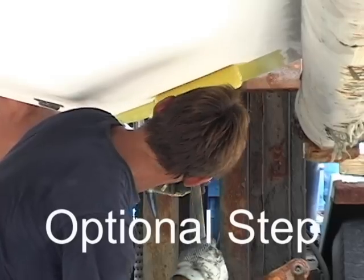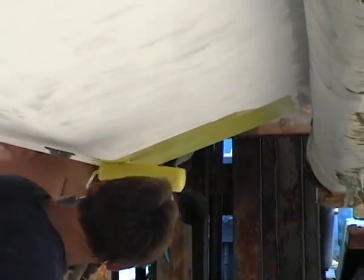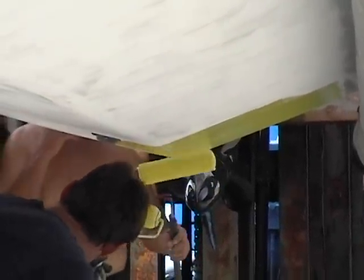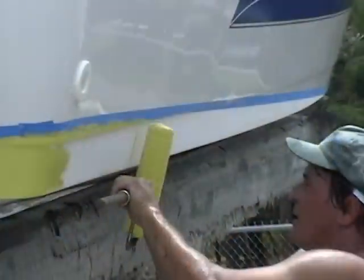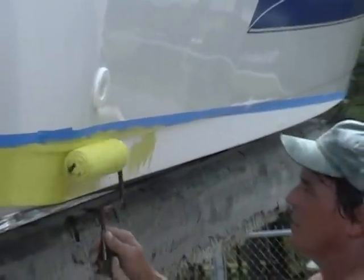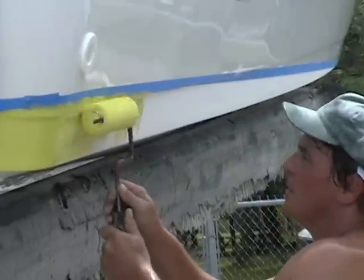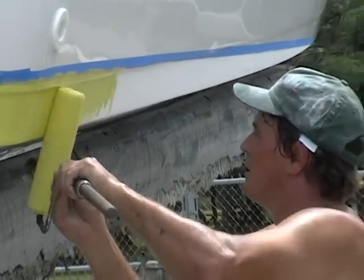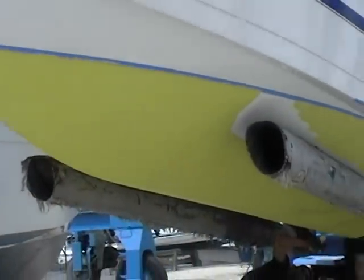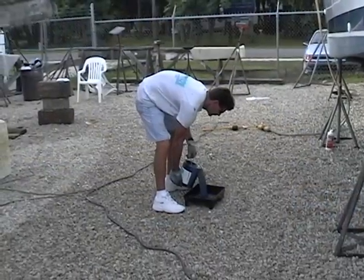Somewhere along that point you have to remove the entire wax, throw away the rags, and then you can start painting the boat. As an optional step, you can put on a tie coat between the sanded gel coat and Super Shipbottom. We don't think it's necessary, but a lot of dealers think that it helps the paint stick. It's the dealer's personal preference, and it can't hurt, but you can't rely on it to hold the paint on, because the tie coat will come off too if there is mold release wax present. They've done a good job with the tie coat.